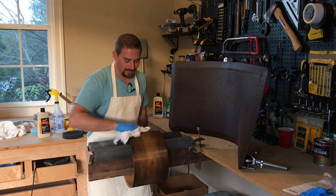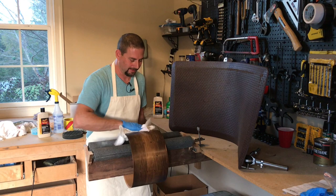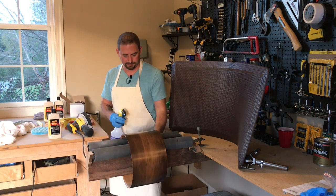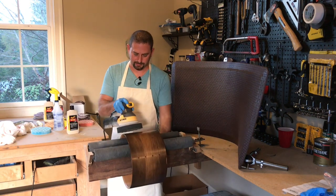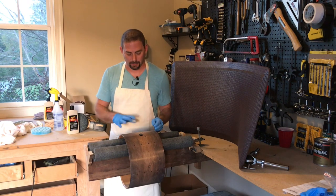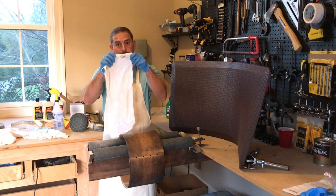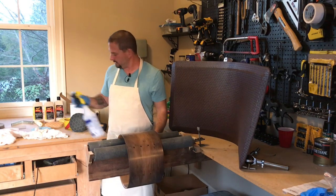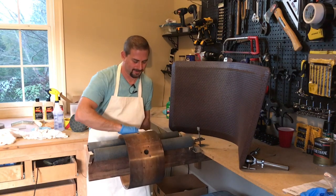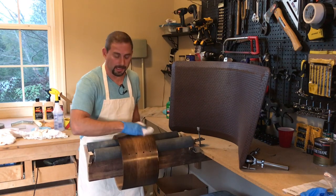What I love about this stuff is that as you go through the grades of compound, you're also polishing these drums so you don't get the same kind of haze that happens with sanding. So here's my fine pad — let's get the fine cut cleaner, shake it up, dampen the work piece, add our compound, and dab it across. I'm also doing this as much as I can against the grain. Let it cool down. Now I'm going to grab my fine cut rag, give the drum a little lubrication, and take off this compound. When I take it off, I'm going with the grain — it does have an abrasive in it, so I kind of want to take it off with the grain. I don't know if you can see it in the video, but we already have a nice shine going on here.